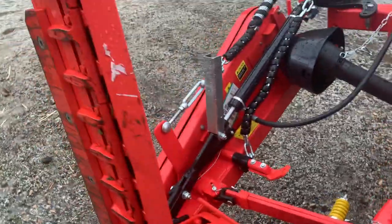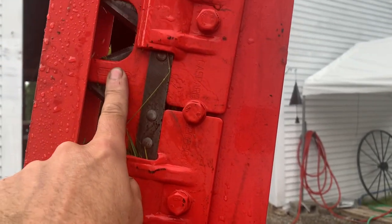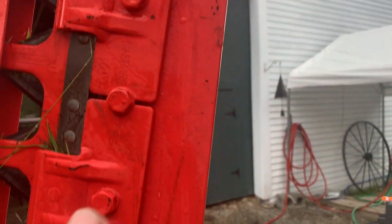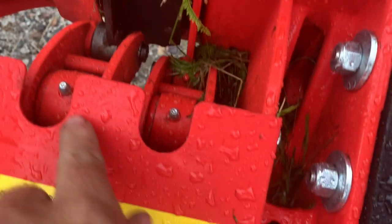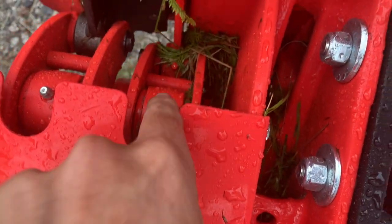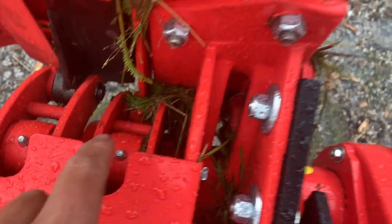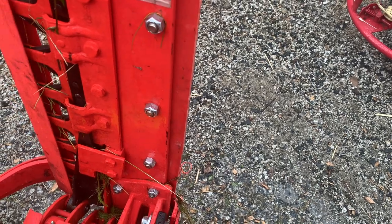Now that I've used it and washed it all down — here's your stay rod, this is what holds it up. The way these sickle bar mowers work is your fingers, rock guards, and the knife sections both move, so it's like scissors. You can see here on this cam right here, it's like a crankshaft — you've got one for the knife and one for the fingers, so the whole thing is moving. You've got two moving parts and it runs super quiet.